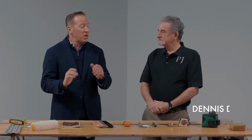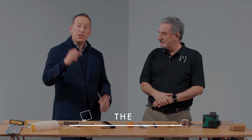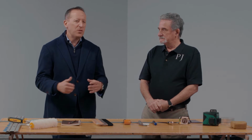So Dennis, let me ask you a question. With a grass cloth, one of the things we talk about is that you have to shade an entire room, right? Meaning some of the grass cloths that we know are gonna go darker to lighter. So one is we wanna make sure we shade. Two is we wanna make sure we reverse. And when you're shading, do you shade more than 3 strips at a time?